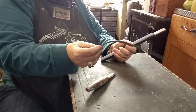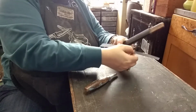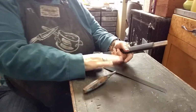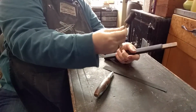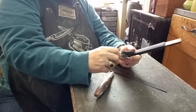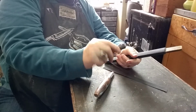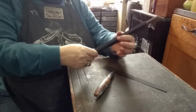And this little strip that I peeled off at the beginning, I'd cut this into about thirds, and I could use these as a slap wheel on a slotted mandrel in my flex shaft for this type of a thing, where this spins and it creates an emery effect in my flex shaft as it spins. It's like a barrel effect. Anyway, so that's your little emery stick lesson for the day.